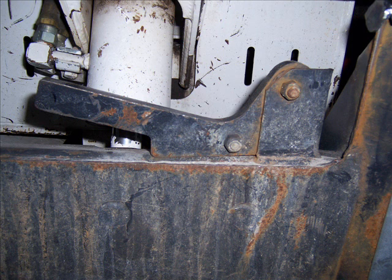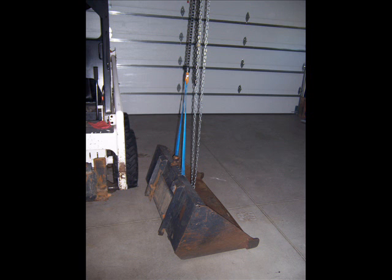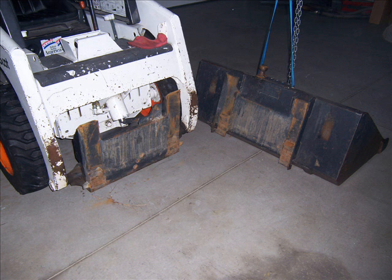Here's the release. You pull this thing up and you release two latches that hold the bucket on the bobcat, and you can take the bucket off and simply set it aside. What you've got is the front flange mount on the bobcat itself. You can see how the bucket attaches — there's two lips that slip over the top of the mount and then two latches that come inside, and there's two protrusions welded on the bucket to hold it on permanently.